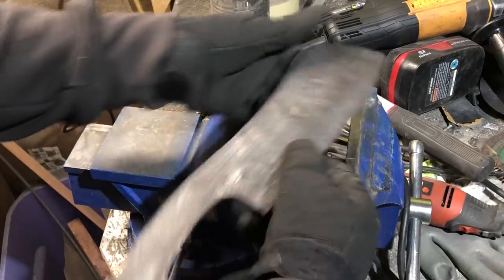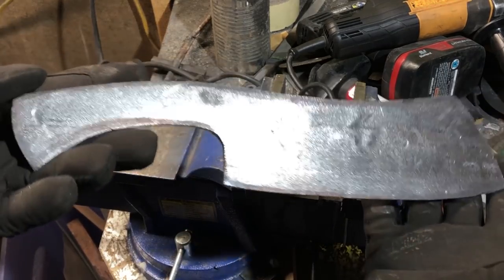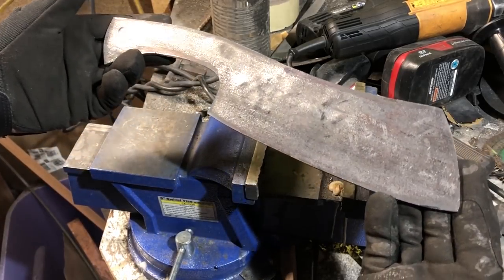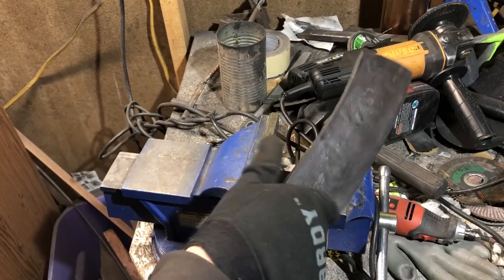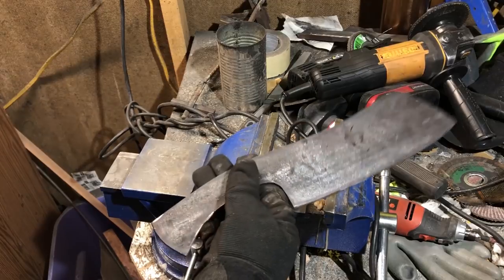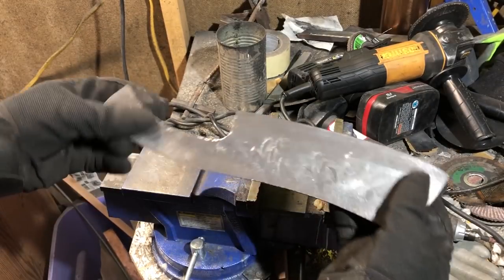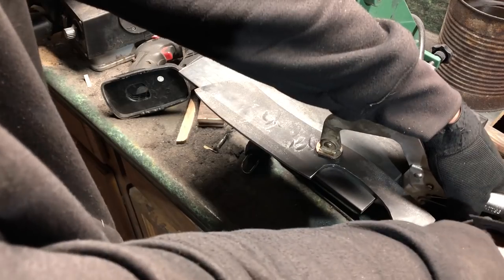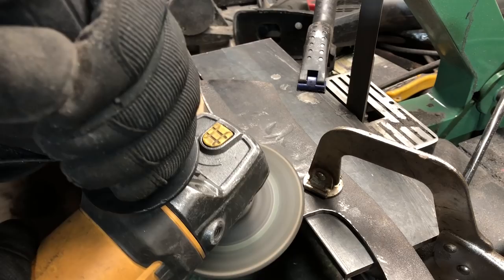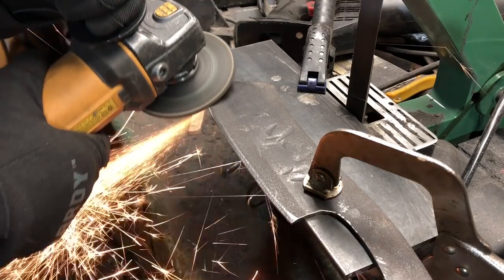Once I'm satisfied with the overall shape, I'm going to put the edge in here. Now under ordinary circumstances, this would be the point where we would put in a bevel, heat treat the knife, and then come back after the heat treat and put in the final edge. But since I'm working with a scrap of mystery steel here, and I suspect that it's probably not hardenable, I'll be skipping that step and just going straight to putting in the edge. I do have a lot of other videos on knife making, and in many of those I go through the process of heat treating — so if you're interested in learning about that, by all means check out the rest of the videos on my channel. But since we won't be heat treating with this project, I'm actually going to take the bevel on both sides straight down to the edge.